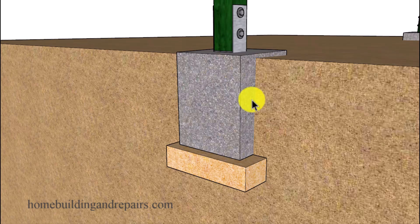This can happen when you over-dig the footing. Let's say you needed a footing that was going to be 12 inches deep and you dug your hole 14 inches, and instead of leaving it, decided to fill it back up with soil that wasn't compacted. One of the reasons we dig a footing in the first place is to get a little lower to where the soil is going to be compacted a little bit better.